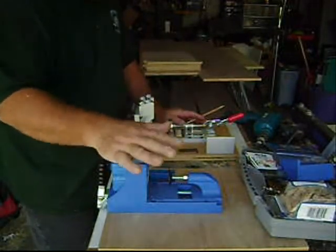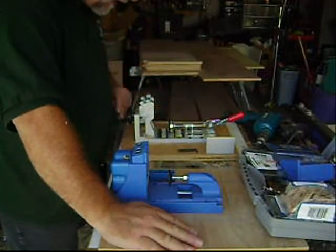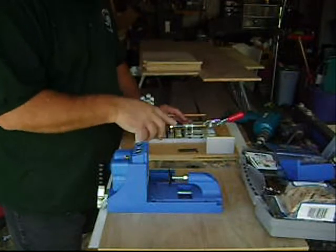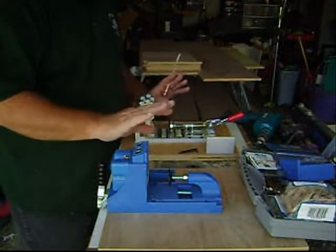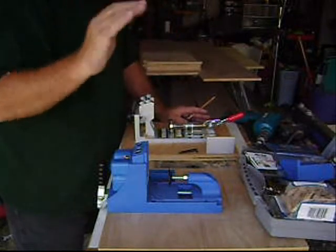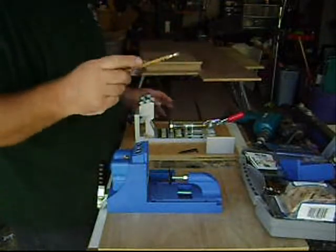When my son is building up his woodshop, he's going to get this one for me, and that's the one I'm going to go get next time. But they do the exact same thing — they put pocket holes in, which means they drill a perfect hole at the perfect angle so you get the strongest joint with a screw, which makes it a lot easier when you're building a quick project such as this one. I'm not having to make dado joints, I'm not having to use routers — all I need to do is cut square edges, drill holes, and sink screws.